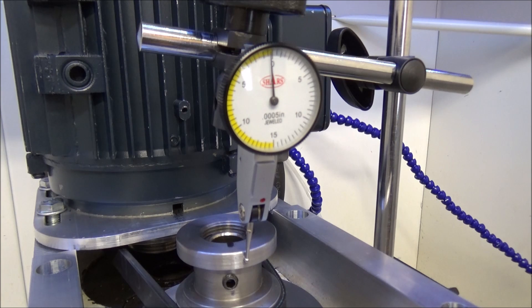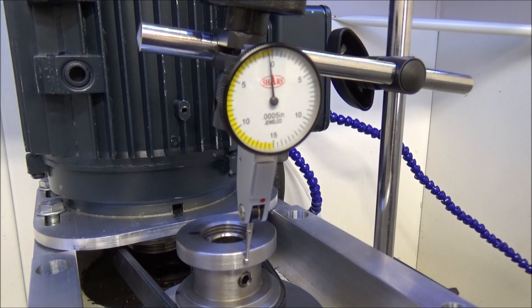I've got the belt drive installed and I'm just checking the runout on the top hat. I ended up putting three set screws because once I used one set screw to clamp it, I realized it was pulling it off — the threads aren't really that tight, and even though you'd think it would stay centered, it actually pulls it to one side just a little bit. I've got it dialed in now to within about a thousandth of an inch.